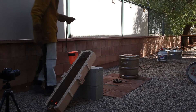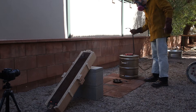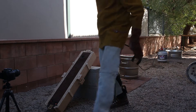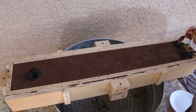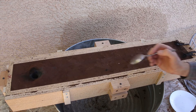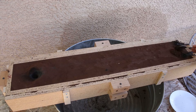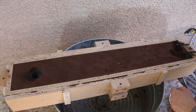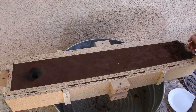Well, that wasn't enough. It did not work. Too much venting. So what happened here is the bronze spilled out of the vents that I made — they're actually a little too large. I was worried that the metal would travel all the way down and solidify before it reached the tip of the sword, so I over-vented just to make sure it would rush through the mold. Unfortunately, that led to this one failing. But it did answer the question that the metal will travel this far before solidifying. So let's dig it out and see what it looks like.